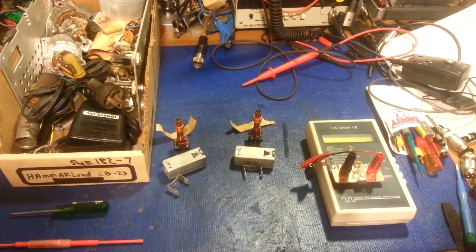I had gone through and measured the resistance — they were all fine. I even lifted a few legs of a few resistors and tested them — everything was fine. The only ones I ended up changing were some of the main power supply dropping resistors off the B+ rail, just because they were slightly baked — they get hot to start with. A lot of people said in the comments section of that last video about silver mica disease or silver migration — it's a common problem.